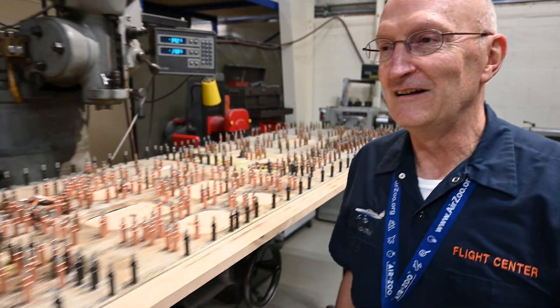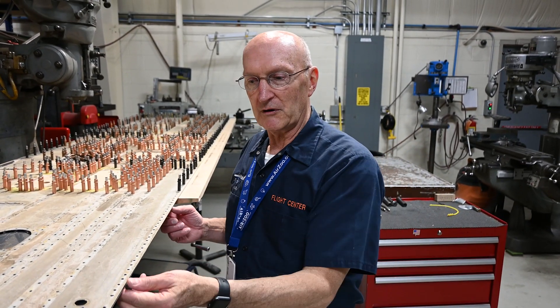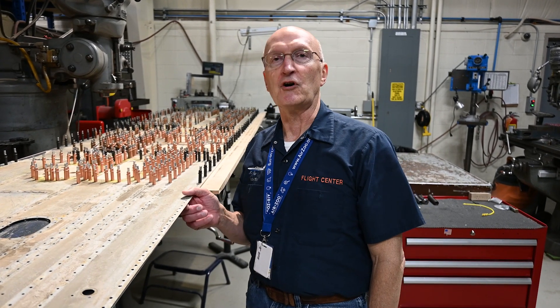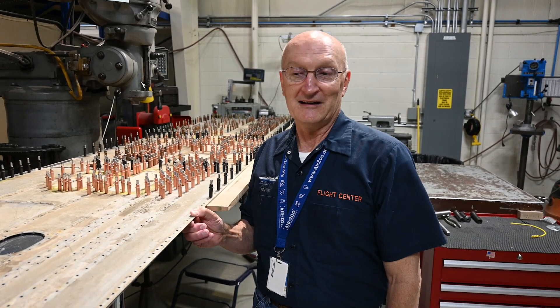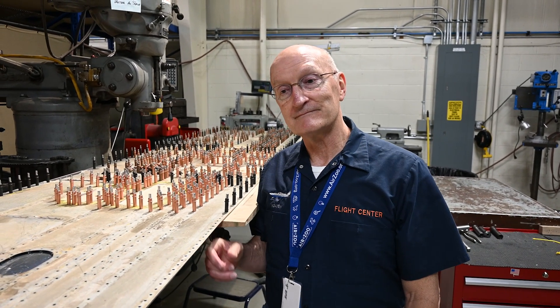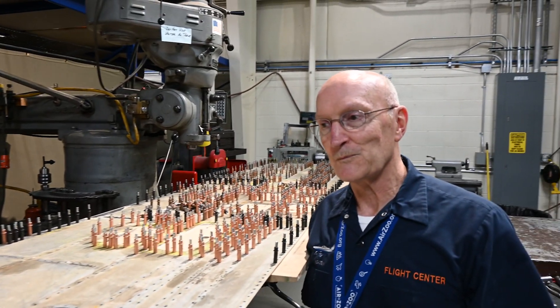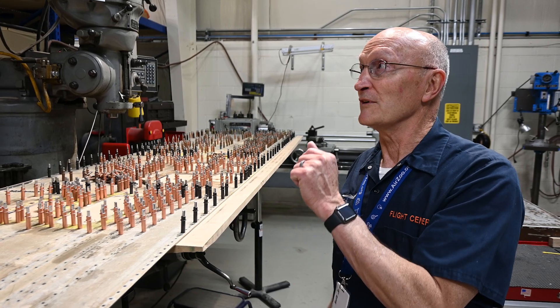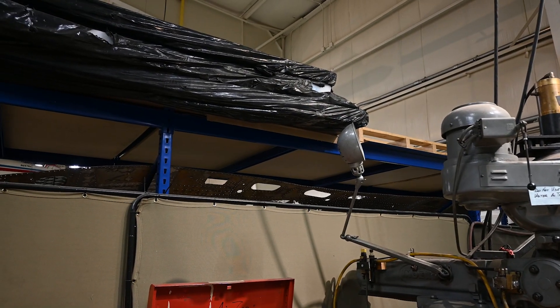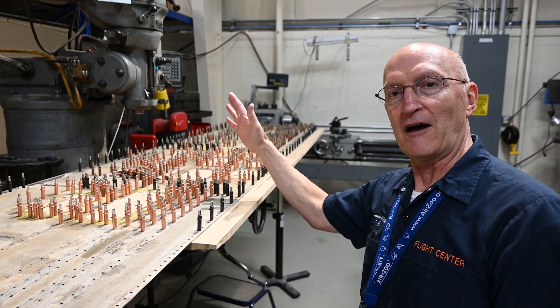Why are we not using the original skin — obviously we try to use as much of the original metal as possible. There's so much damage in the original that to patch it, there's almost as much work as replacing the whole thing, so we're going to replace the entire skin. The new skin will also make it much stronger, and that's a structural point of the aircraft right in the center. It wasn't until this part of the aircraft was taken off and you look closely that you can see — obviously the big holes, but even all the way across this whole piece of metal there are little dings and holes everywhere. This is the good one. The next one's even worse.